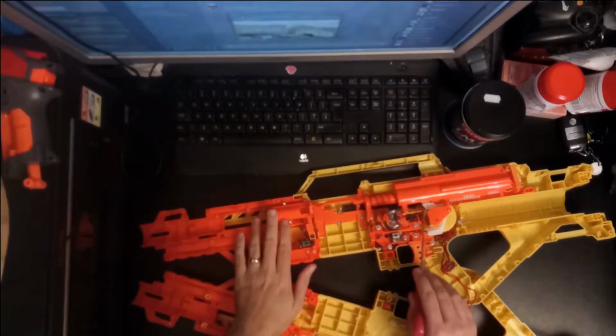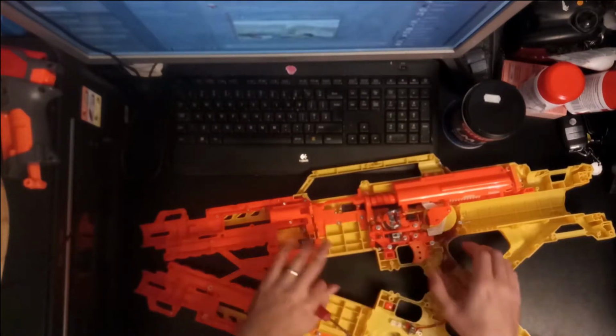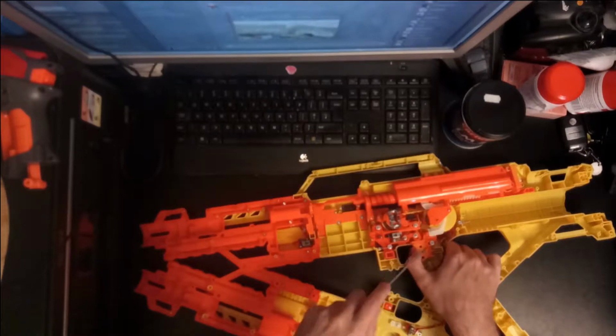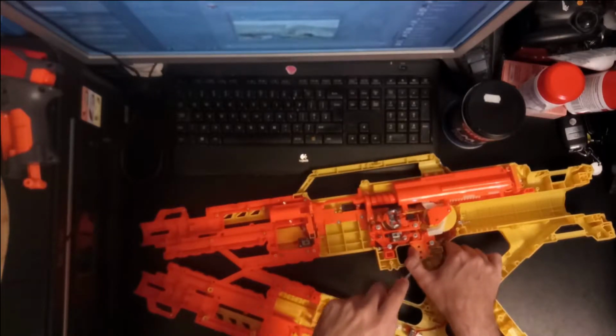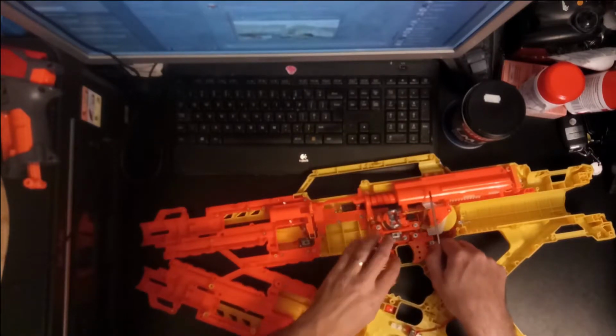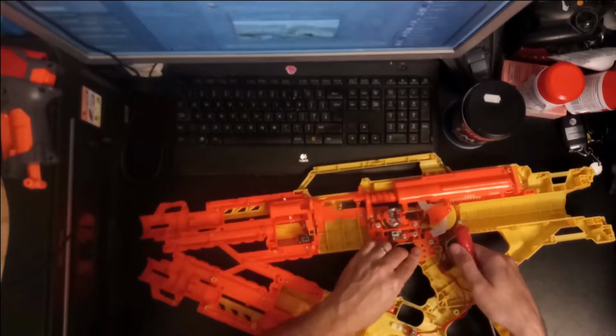And the final thing here is your cycle control switch, a micro switch here. When you activate the trigger, I'll go over these mechanicals in a bit, it pushes this lever, that pushes the switch under here, which actually the switch is this way. So the plunger on the switch is at the top here, goes down. You press this, and that starts the cycle off.